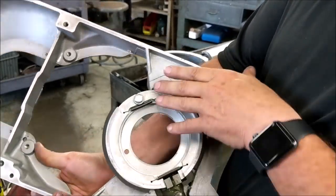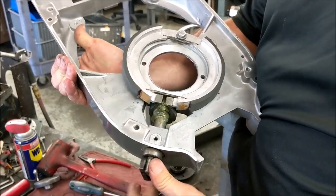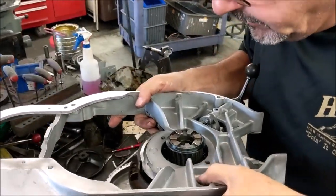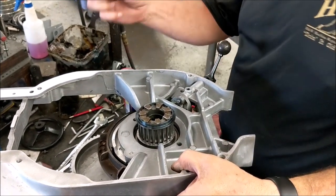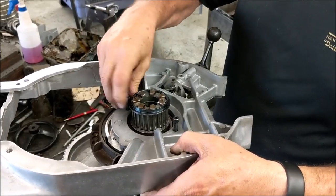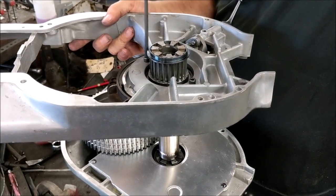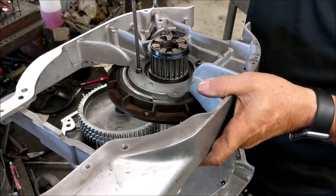This is where it goes on the flat side. It's got new brake shoes and new brake springs in it. See the grease in here — that's all greased up. Because when you move your brake, you want it to just slide back. So you kind of line that up with the flat, and there are two holes where the screws go. Slide it down. Get your two quarter-20 socket head cap screws — they could be either one inch or three quarters of an inch. Just want to go down slowly on each side to make sure everything's going down equally. We are not down yet, keep going. Once you get down, make sure you're plenty tight.